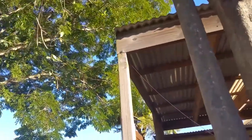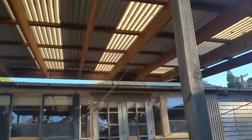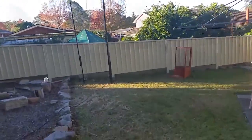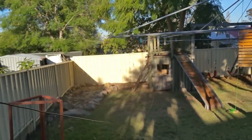Probably at least the last five to seven metres roughly. So we're going up here to the top of that post, and then along and up to there. It doesn't have to be straight — it just has to be spread out evenly apart, and try to run off in the same general direction as the existing elements if you can. Here's my counterpoise for 40 metres, which runs across to that cubby house thing, and once again we're elevated.